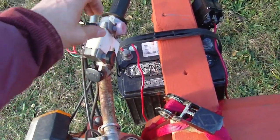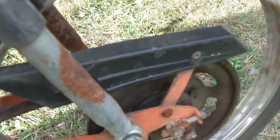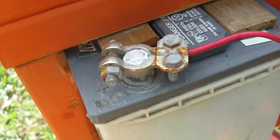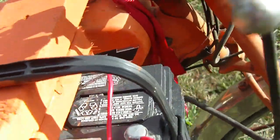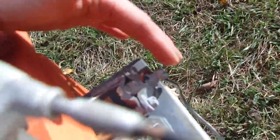The switches here were actually off a kid's electric Jeep — you'll probably recognize those. With two new batteries on this thing it would be a lot better. What's holding the batteries on is just some two-by-fours cut to the size of the battery — slightly smaller so they're tighter when screwed together and hold the battery in tight. A tie-down strap holds it for now. A better way would be to build a bracket, but I didn't want to damage the moped since I'm going to put the engine back on one day. I have two 12-volt car batteries in a series circuit — hook positive of one to the negative of the other, then positive goes to the relay and on to the motor. No electronics at all.